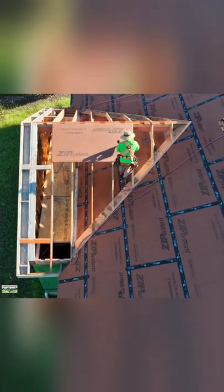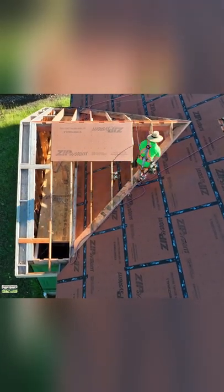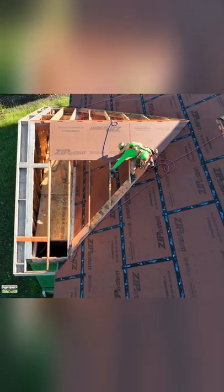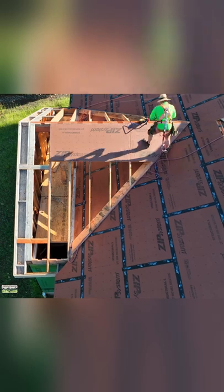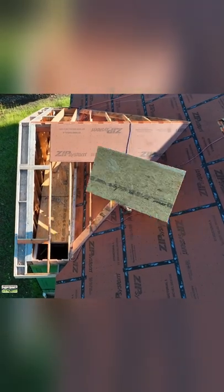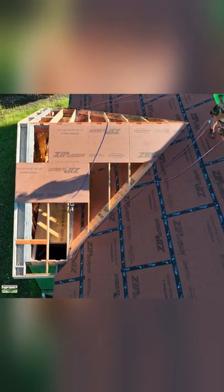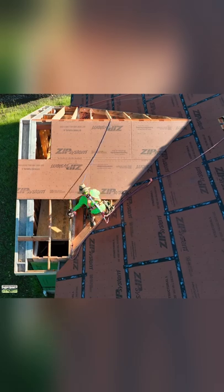On roofs with a short fascia line — so there on the bottom left it's like 4 feet — I prefer to start the sheathing from the top and work down. I have a place to stand, it's easy, and I can dial in those angles. I also like to start with a full 8-footer if possible, then give numbers for the angle, and that gives us a pattern. After that, my job is just to feed numbers to the sawyer.